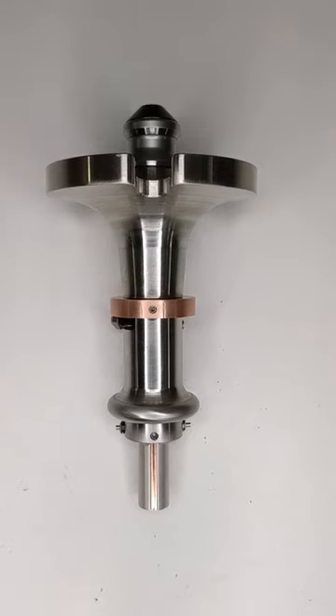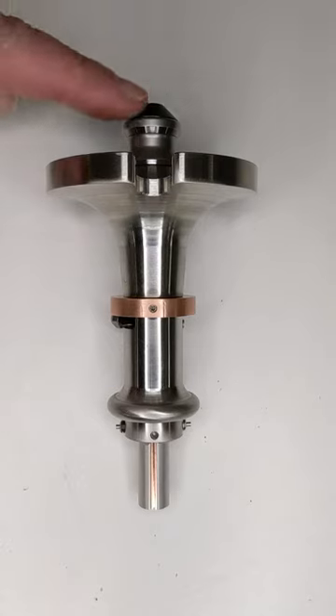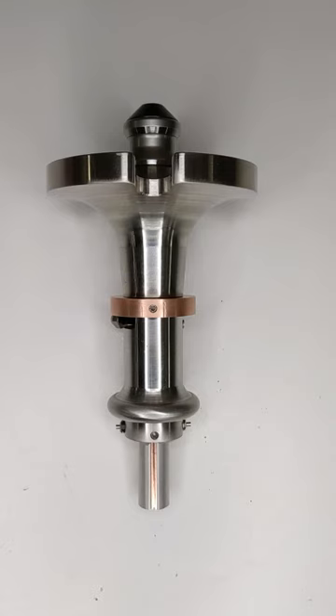This tool, developed by Prairie West Design, is used on one of our machines for resistance welding a wire cage component used in a high-tech sensor. This quick-change tool uses a zero-point stud and a pneumatically actuated zero-point base for mounting.